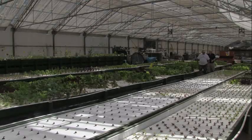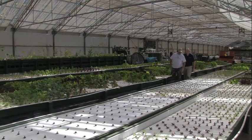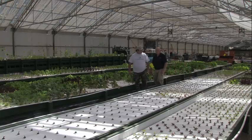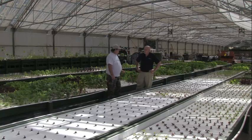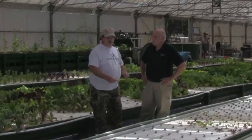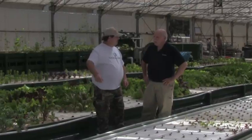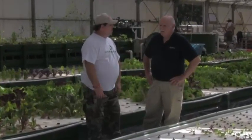Kenji, I'm really interested in these pipes you've fitted along the side here, these three-quarter inch pipes — what's that all about? These are air lines. We originally planned to put air stones in our tops, and instead we went with a three-eighth inch weighted perforated air line. When we first put them in we found that our regenerative blowers only filled up the air lines halfway, so we had air only halfway down the trough. To correct that, we ran a three-quarter inch PVC line all the way down to the end of the trough and plugged it into both ends of the air line, and we got equal pressurisation throughout the trough.